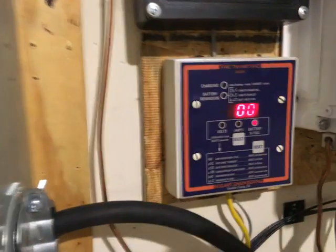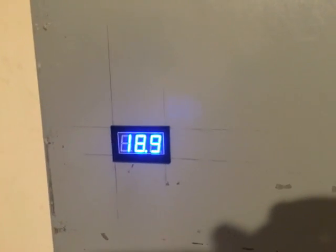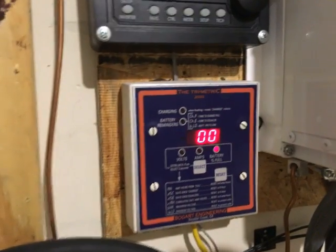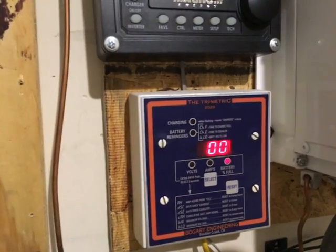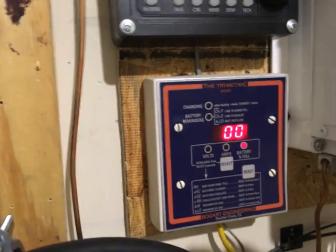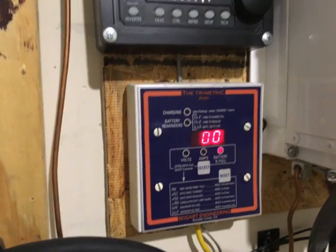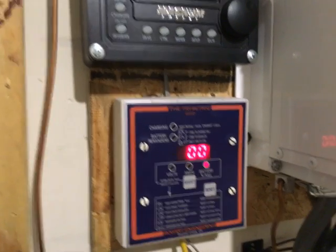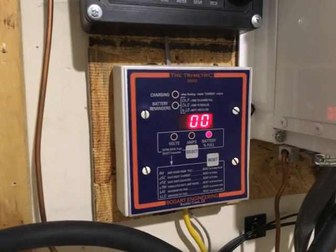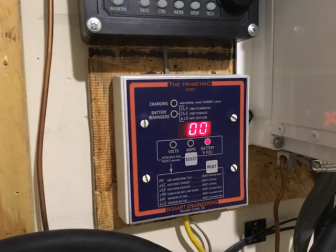The end result is that this capacitor bank actually did work just like I wanted it to. Not only that, but the suggestion I received from Phillip over at Guns Games and Racing — about taking that AC capacitor out of my setup from my refrigerator — did pay off in huge benefits and saved me an additional 15% capacity on my nickel iron batteries.